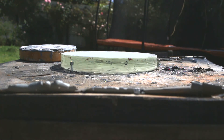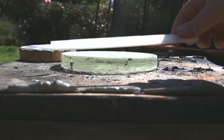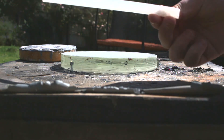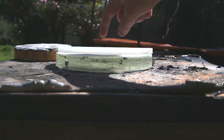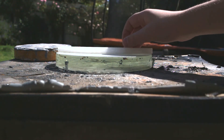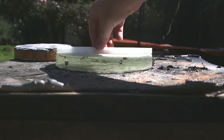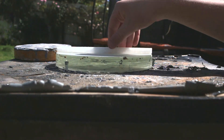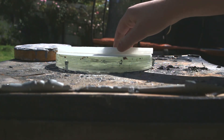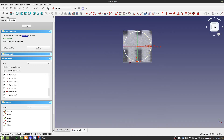After some hours of grinding with this 60 grit, here's my 3D printed template that has a very shallow curve corresponding to F7. As you can see, there's a decent curve in the mirror towards the centre — the curve looks just about right. There's a very slight gap on the other side, but I think that's pretty good. Now that the grinding is actually finished, let's explain more about what we actually just did.